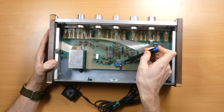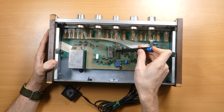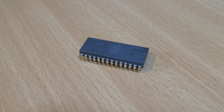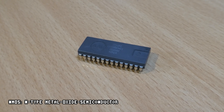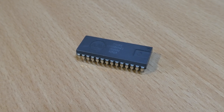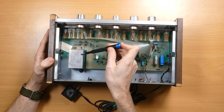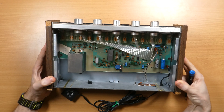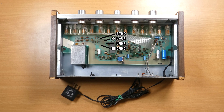Here we have another potentiometer, which I believe is used to fine tune the clock frequency, and finally the IC that basically handles absolutely everything. This custom chip, designed in-house by Atari and manufactured by American Microsystems (AMI), is interesting in that it used NMOS — N-Type Metal Oxide Semiconductor Logic — an old chip technology that we don't even have the capability to manufacture anymore. It also runs on completely different voltages to modern ICs, something I'll cover in more detail in the next video. Finally, there's the RF Modulator, which takes the video output from the chip and turns it into a signal that can be displayed on a standard TV. Atari have helpfully included four very big and obvious links that carry these signals, and this is where I'll tap in to pick them up for my S-Video mod.